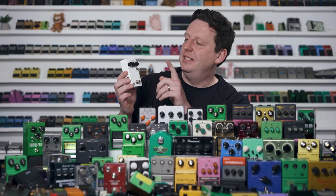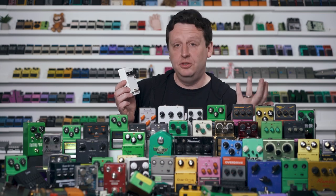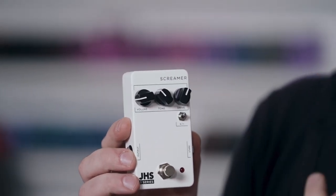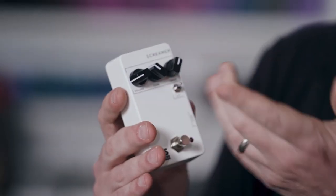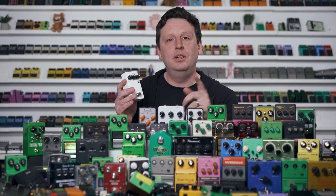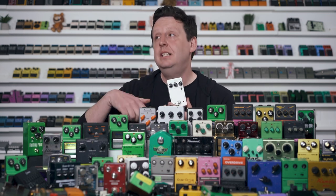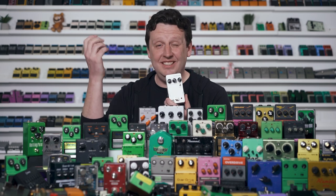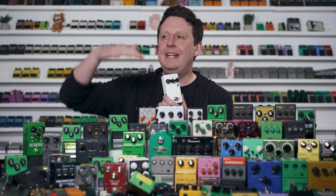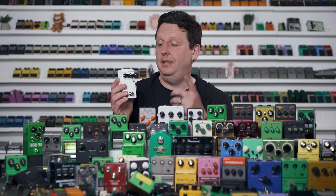I'm going to set the volume around here because this pedal is crazy powerful and loud — you'll see it's really powerful and it's going to overdrive my Fender style amp. The tone control I'll keep fairly on the dark end, but even though it's dark, the modifications are letting some presence through, which is something the normal tube screamer really struggles with. The drive is a little more than halfway. And the most important part of this tonal recipe is putting the switch up — this engages a different forward voltage in the clipping. The normal tube screamer is very compressed, kind of chopped off with a lot of hairiness. When you go up on this, it raises the headroom of that clipping and feels just like a cranked amp. So I'll add some spring reverb from the amp and let's do it.